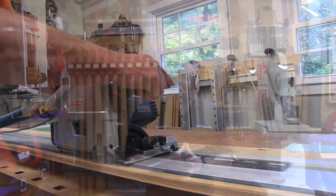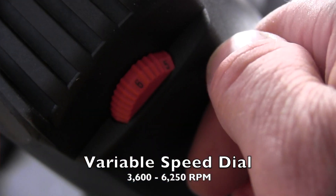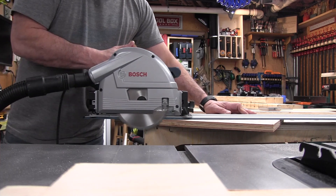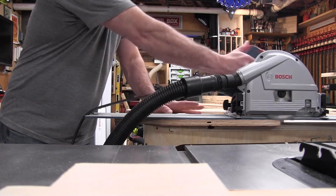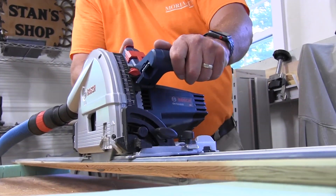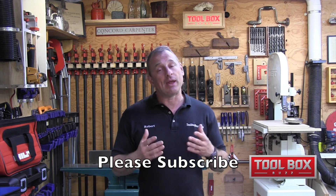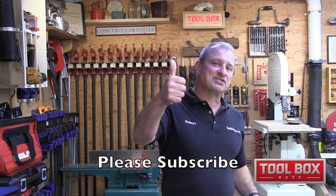The pricing looks steep but it's certainly an investment — just wait until you see the build quality. Final thoughts: the attention to build quality, build detail, and usability experience that Bosch put into this saw is impressive. I would put the Bosch saw up against the corded Festool — that's the comparison I'd make. The Bosch tracks deliver precision, power, and are ideal for making table-saw-quality cuts in wood and wood-based sheet goods such as laminated particle board and plywood. The track guidance system provides exact fit, precision, and adjustments for end-to-end plunge cuts. It's just a really nice system — a great shop saw.